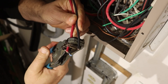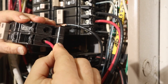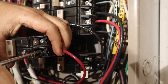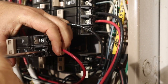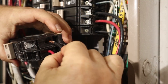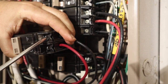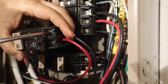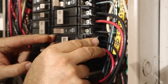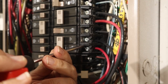The two hot wires need to be stripped to length to go into the circuit breaker. Insert the conductor into the circuit breaker and tighten down the screw to hold it in place. Repeat this for the other conductor. To install the breaker, this style hooks on the outside edge, then swings to the inside, and gets pushed securely in place.